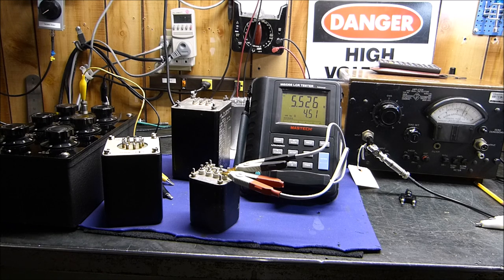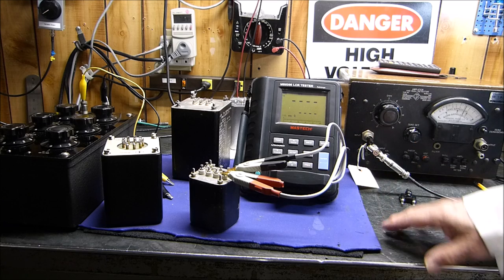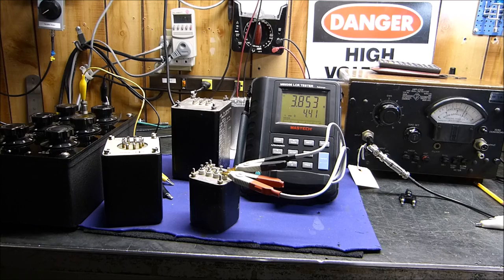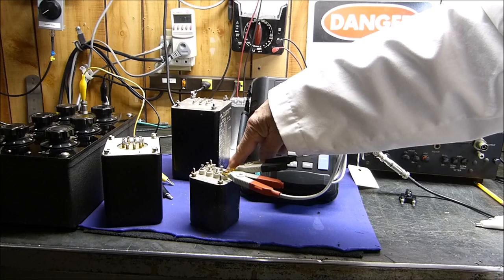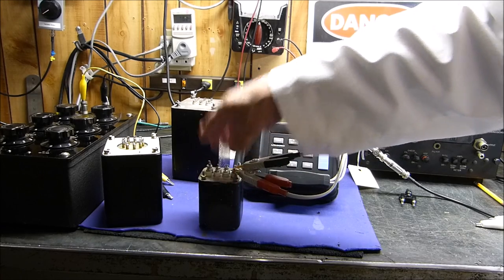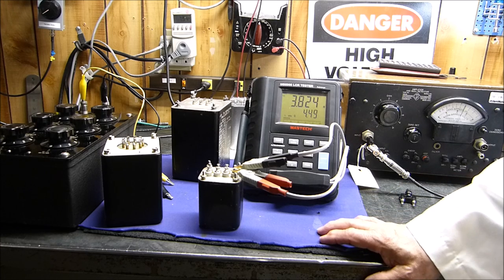No, these last ones have worked. 100 hertz, 120 hertz, a kilohertz. But back at a kilohertz, up there, it's even 3.8. Now, the inductance value of this transformer is not frequency dependent. Inductance is not frequency dependent. Inductive reactance definitely is frequency dependent. And depending on the size of the reactor, the inductive reactance absolutely depends, and will make the frequency that you measure it with extremely important.